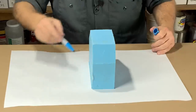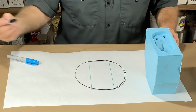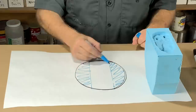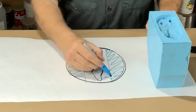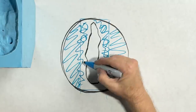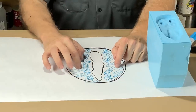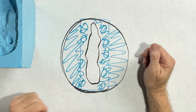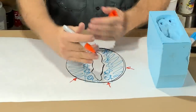In a perfect world you'd want this mold to be nice and round — a big round mold. But look how much rubber you'd be wasting. Keep in mind the horse is living in here like this, so we already have a tremendous amount of rubber surrounding the model. We filled it up beautifully last week with chunks of rubber. But there's a reason you use a round mold instead of a square mold: it's very hard to put even pressure on a square mold. A round mold puts even pressure from every direction all the way around, giving nice even closing pressure.